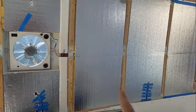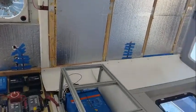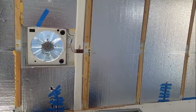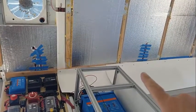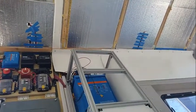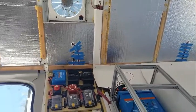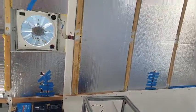That aluminum strip will be upholstered, matching those windows, tying the front and back together with upholstery coming forward. On the walls where I have FRP plastic, those will be upper cabinets, and the aluminum cross members will also be used to support the cabinets — I'll attach the L-bracket to the cross member to mount each cabinet.